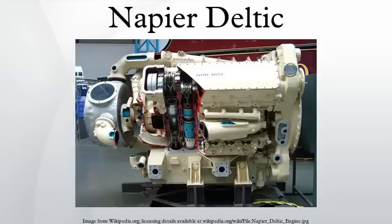For the 18-cylinder design, it was possible for firing events to be interlaced over all six banks. This led to the even, buzzing exhaust note of the Deltic, with a charge ignition every 20 degrees of crankshaft revolution, and a lack of torsional vibration, ideal for use in mine hunting vessels. It should be noted that the nine-cylinder design, having three banks of cylinders, has its crankshafts rotating in the opposite direction. The exhaust lead of 20 degrees is added to the 60 degrees between banks, giving firing events for adjacent cylinders in the same bank 80 degrees apart. By interlacing firing events over all three banks, this still leads to an even buzzing exhaust note, with charge ignition occurring every 40 degrees of crankshaft revolution with consequent reduction of torsional vibration.